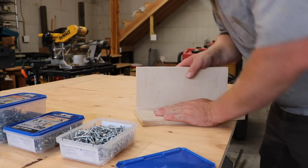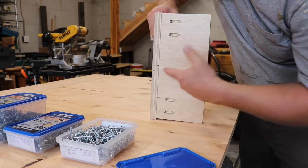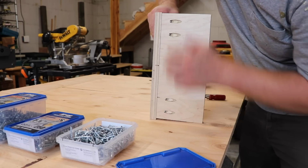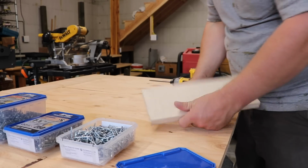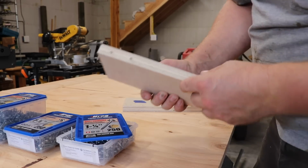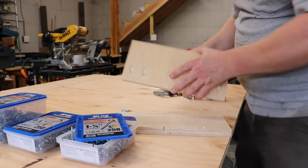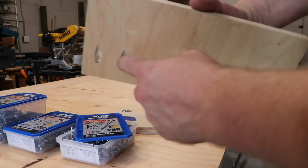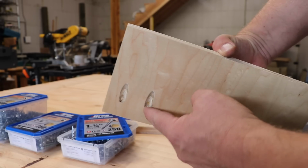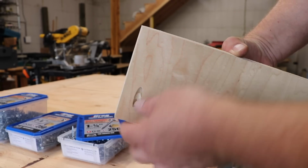I don't know what I did wrong, but it's pretty freaking wobbly. I don't know, maybe we should be putting more screws in here, like maybe one every 6 inches instead of 2 on each end. Something's not set right. A 1¼ screw barely penetrated the adjacent wood. I almost can tell you right now that it's the depth of the drill bit, because those screw heads I don't think are supposed to even be visible. I mean, the screw should be fairly well hidden in there.